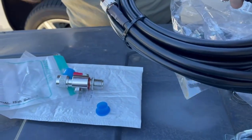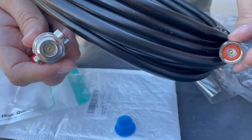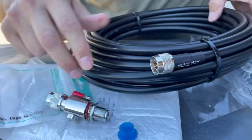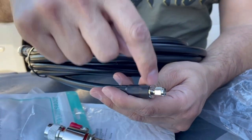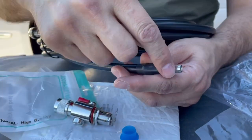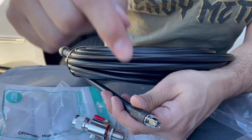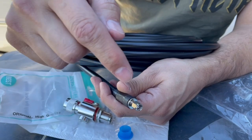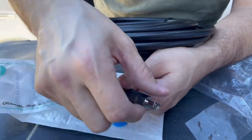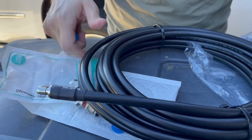I also got this cable — it's LMR400, I got it off Amazon. On this side we have the female, and then this is the N-type male, and we're going to screw this in. On the opposite side, this one goes directly into the miner — it doesn't matter if you have a RAK miner, a Bobcat miner, or any of the others. This end is called an RP-SMA — the RP stands for reverse polarity. If it's a male part, the RP makes it reverse, so it's actually female. It's very confusing, but I'll put all the links in the description box.